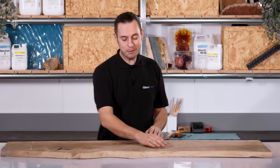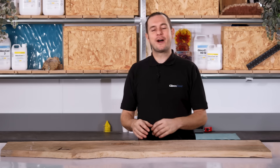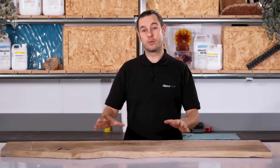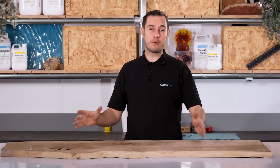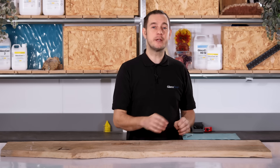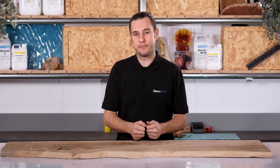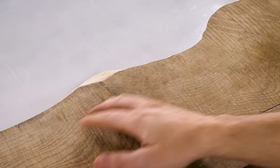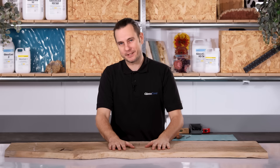So here we have our beautiful waney edge plank for the river table. I have seen a few videos online where makers suggest an alternative way of saving resin — simply taking a slab of wood the same size as your table, routing a river shape a few millimetres deep, and then filling that with resin. Whilst this will indeed save some resin, it results in a pretty flat looking piece that misses the entire point of resin river tables, which is the way the grain and the character of the wood follows the contours of the live waney edge. So my method will still use the classic waney edge planks like these.